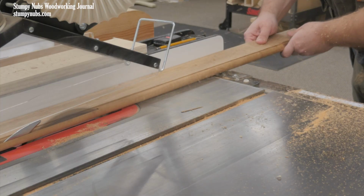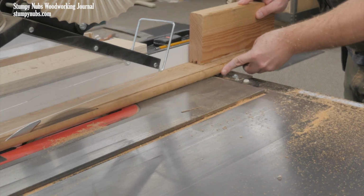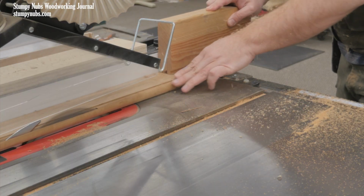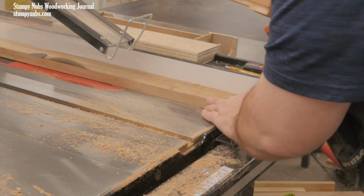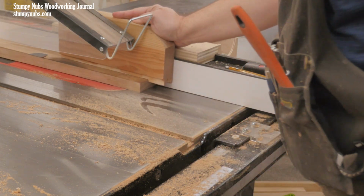The problem is most common when you near the end of the cut and you pause to reach for your push block. Learn to keep the board moving at an even pace from the beginning of the cut to the end. Finding the right speed may require some experimentation because you can also feed too quickly for the blade you're using. The faster you feed the wood, the harder it may become for the blade to keep up with the sawdust that has to be cleared from the kerf.